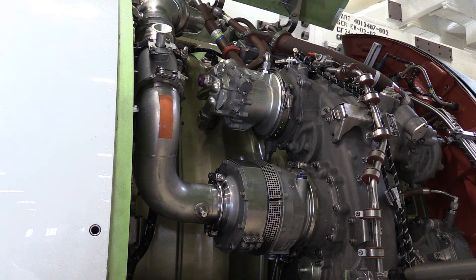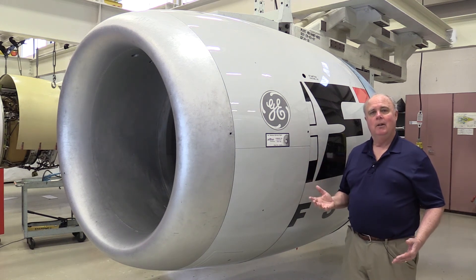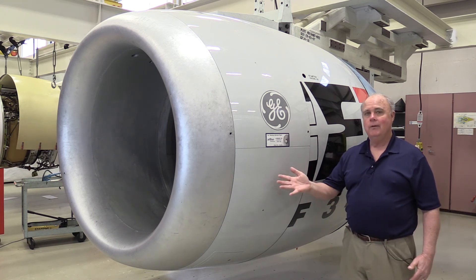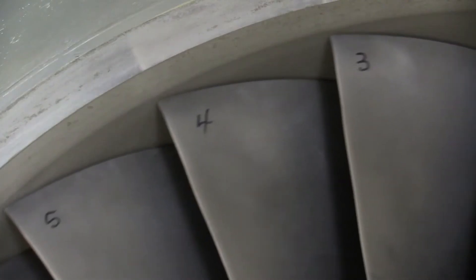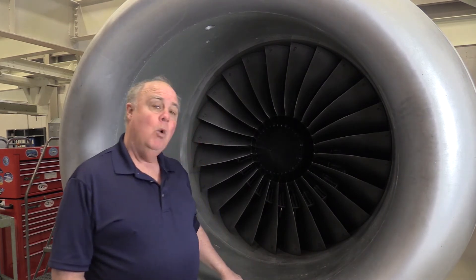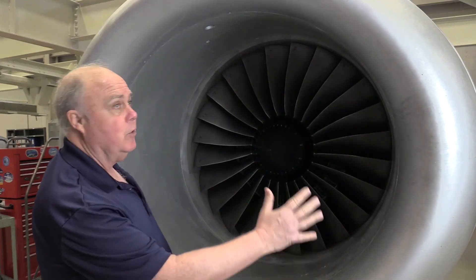Once we're done with that, we're going to close up the nacelle and get ready to install the caps. Now that we've finished the preservation of the internal systems — both the oil system and the fuel system — and we've closed up the nacelle, we're going to give you a quick summary and demonstration on how to add the forward cover and the aft cover to prevent FOD and possibly moisture in the engine. Once we've taken care of everything under the nacelle as far as capping and covering any openings, then we're going to deal with covering the inlet. The main purpose for covering the inlet is to protect against possible FOD from entering through the fan and damaging the blades, or going into the core of the engine where you could get FOD into the turbine. The secondary thing is to eliminate the amount of moisture that could gather in the inlet. One area of real concern is the abradable material near the fan — if that gets water on it, it could expand, causing excessive rub on the blades when you first start the engine.